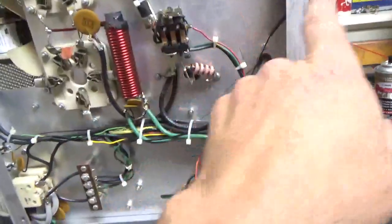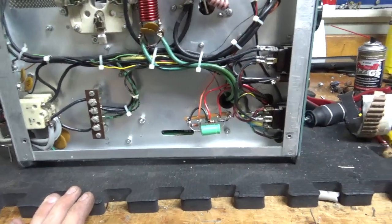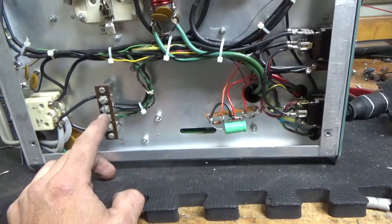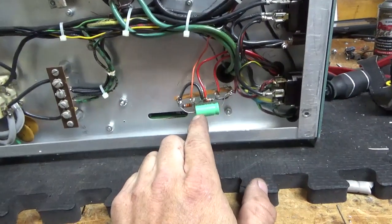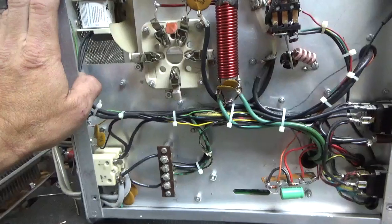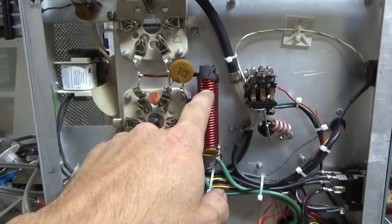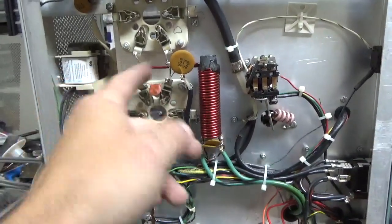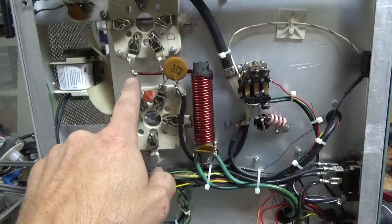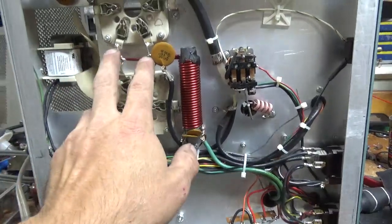Here's the bottom. I secured the wire for his standby/operate switch and zip-tied everything really well. It's temporarily wired for 120V; I'll put it back to 220V. Changed the electrolytic cap. I ran out of copper strap so I used some silver-plated copper — the grids are grounded really well. The filament choke-to-filament connections were just tagged on with solder, so I unsoldered it, crimped the wire over, and put solder on it — now it has a really strong connection for both filament connections.